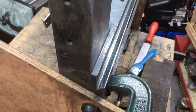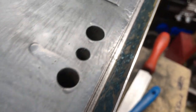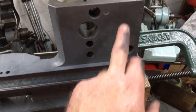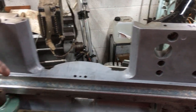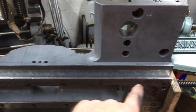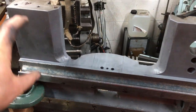Well, that took about 3 hours to get that to print up. We've got reasonable contact surfaces. I'll make sure they're plenty deep, the scrape, so they get some oil in there as well. Checking the drop, which I've got, this basically is 2 thou under that, and it's just been a case of keep taking it back until I've started to get a print on this section, and then the measurements were right.